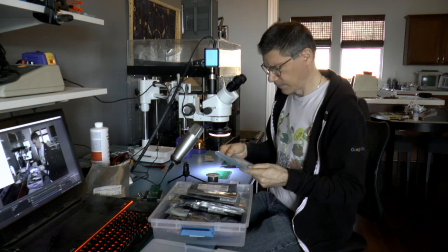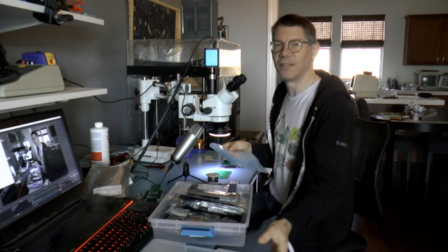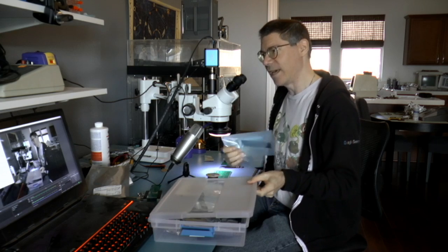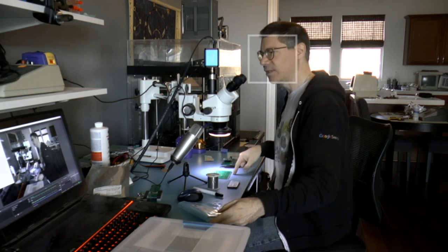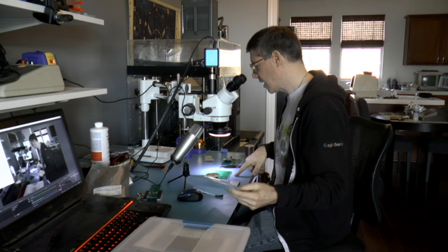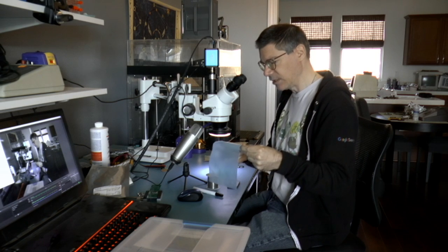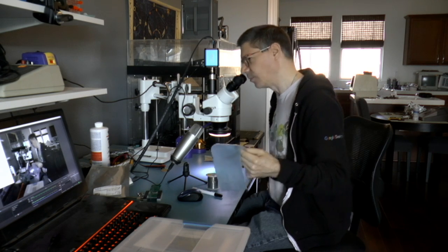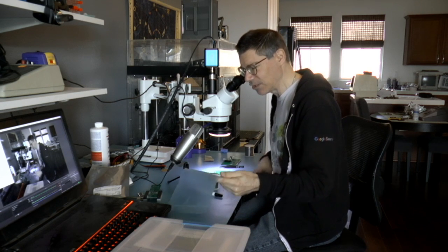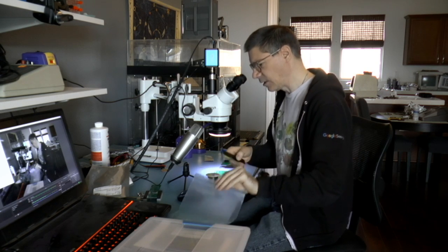It's from Recom. It basically takes anything from, I think, 3.6 volts or so to 17 volts, and it outputs 3.3 volts at 3 amps. The reason that I need such a large power supply, or such high current, is that when I plug in this tester board to the backplane, this really needs to power the entire backplane. So I figure 3 amps is probably nice. What part number is that? It's an RPM 3.3-3.0. It's from Recom Power. So I guess RPM is probably Recom Power Module, and 3.3 is the output voltage, and 3.0 is the current. You can get it on DigiKey, and I think it was only a few dollars. By few, I mean like less than 3.